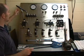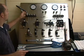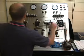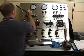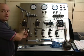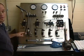What we have here is our pump pressure coming to our pressure manifold. From our pressure manifold I'm going to run one hose from here into one of the number 1 connections on the pressure relief valve.